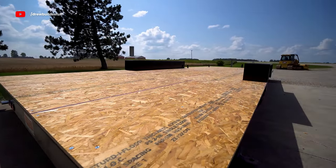Notice in this clip, the shims are only along the two sides. You never want to shim the top or the bottom. Depending on the height of the window, this one had 6 shims. Some of the smaller ones would only have 4. On the outside, I'd cut away those overhanging shims.